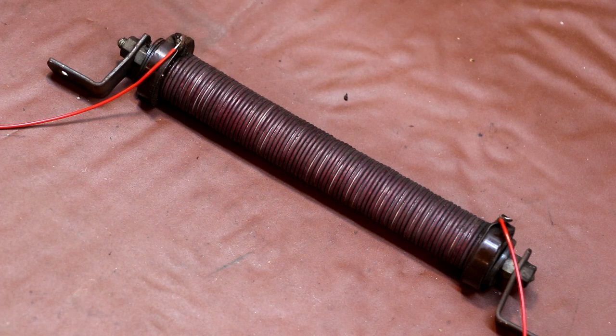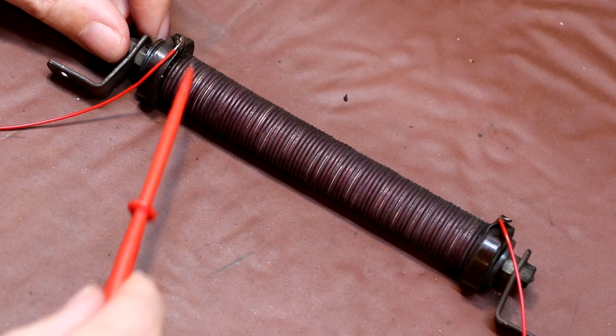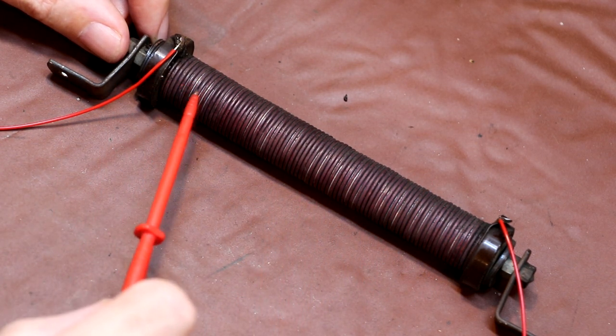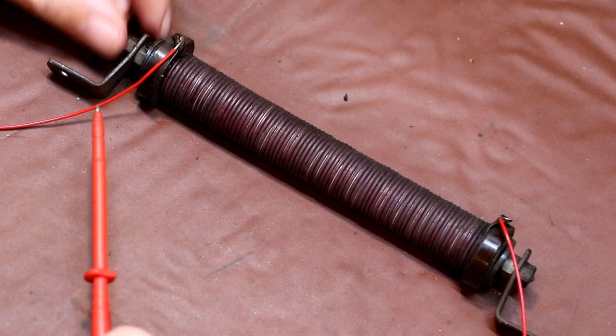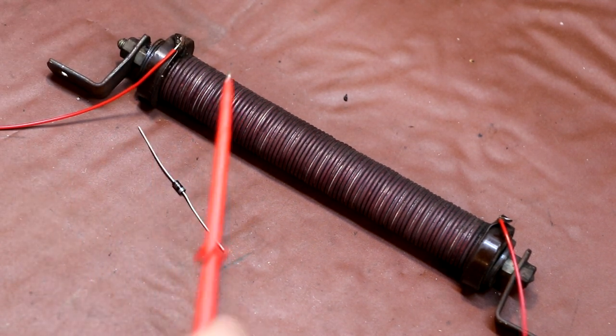So let's take a close look at our copper oxide rectifier. Now, I'm hoping you can see that this rectifier is actually made up of a number of separate discs of copper, and if you count them, I think there's just over 80 in total, something around that number. And each one of our 80 discs is a rectifier in its own right, so it is equivalent to our little diode here, although not quite.